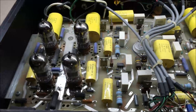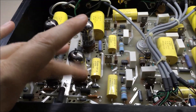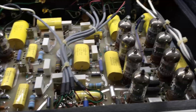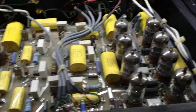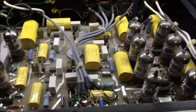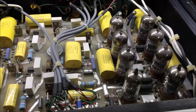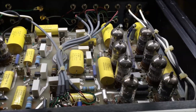I've actually tested these four already and one of them is completely dead, one is weak, one is marginal, and the other is decent. But to be honest, if this was my unit — and I'll end up going back to the customer and asking them about this — I would get 12 matched pairs, three quads of matched pairs, and make sure all of them are matched, just to make it nice and clean. Let me show you the schematic on this thing real quick and show you what I'm chasing down right now.